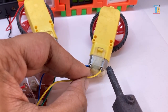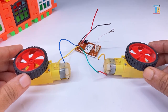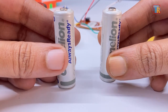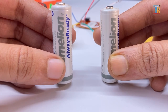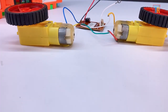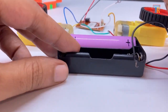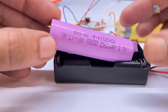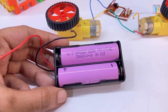For powering this receiver, you can use a 4.5V to 6V supply, meaning three or four AA batteries. However, this circuit draws a large amount of power which can quickly drain non-rechargeable batteries. You cannot use a single 3.7V lithium cell or two 3.7V cells in series, because this circuit operates at a maximum of 6V and lacks proper voltage protection.